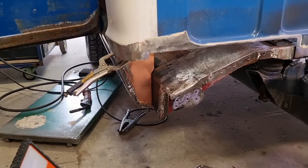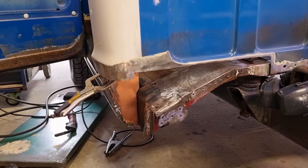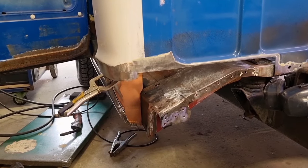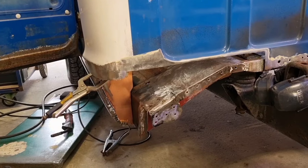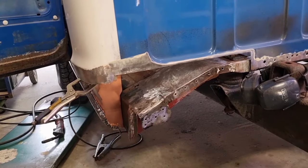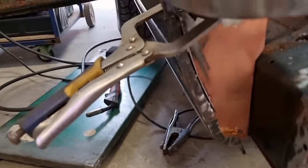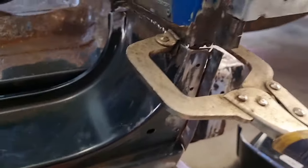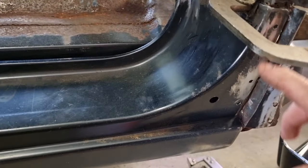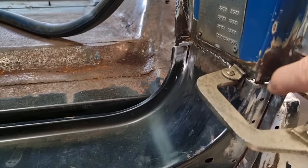And I've also put in some holes to put some plug welds, some spot welds across the floor section just there and just around here. Now there's a few pieces here that have been sort of diced and spliced, so get a weld up that bit there. That's just a little plate that's holding on. Holding parts on generally, so just through here, this piece here, I weld that in. Just got to modify this little corner just here.